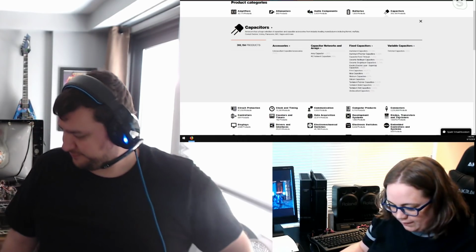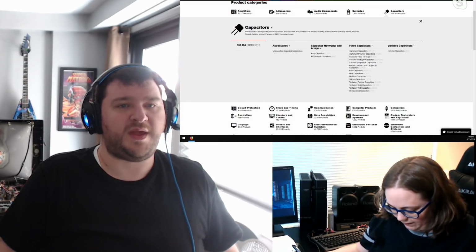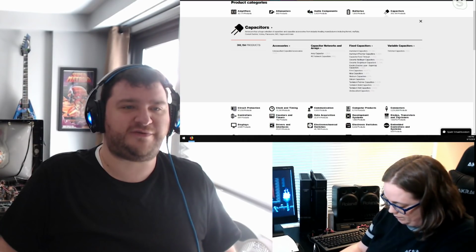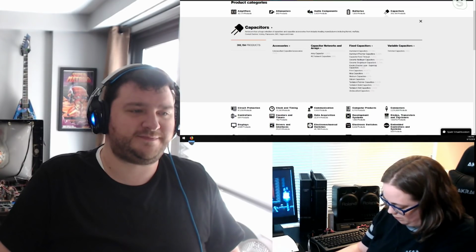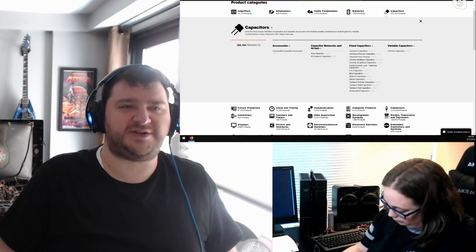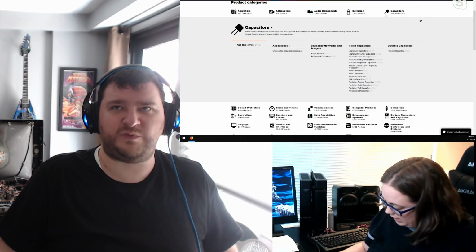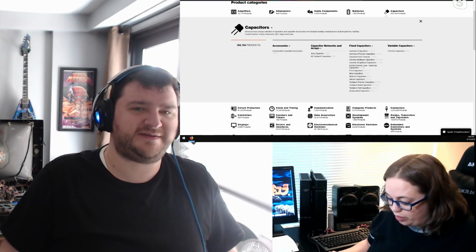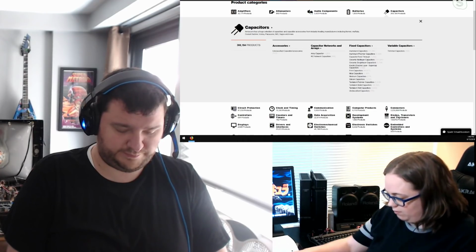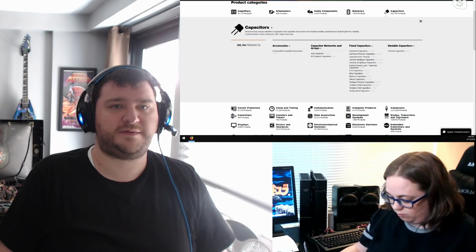470. Yeah, I don't know. Some of these, the 35 volt ones are just weird to me. Yeah, I guess maybe it's a case where they had a ton of them in their warehouse because they already bought it for other stuff, so they just allocated it to that. I'm putting a star next to the working voltage one, because that one was just weird. Actually, what is that one? Let me look that one up now so I can start trying to find something sort of around that. Caps. We don't know. It ended in a 5 volt and then it was 470? Oh, that one was 470 microfarad in either 25 volt or 35 volt, but that wasn't the WV one. Oh, yeah, okay. That one was 470 microfarad, 200 WV.